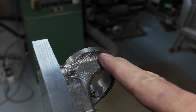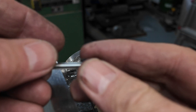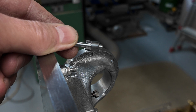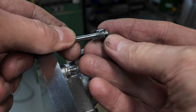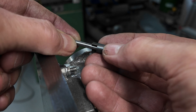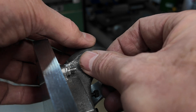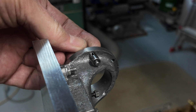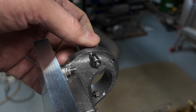Here's our flange and that's where we want to counter bore — and this is our counter bore, there we go. Came out beautiful. We've got our little allen key in there. I'll put a flat on the little shaft and it's set up to cut in reverse, so when we put it through there we turn it the normal way the drill would go.